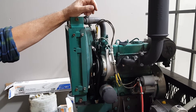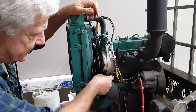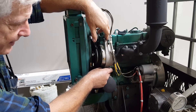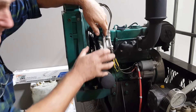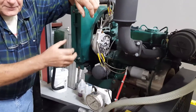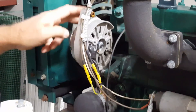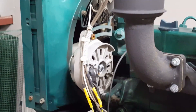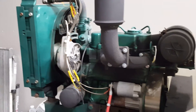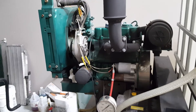It does take a few little adaptations, but typically these alternators have two points of support — one at the bottom where the piece can swivel and one at the top where you adjust the tension on the belt. Very simple. It has worked excellent. This machine has dozens of hours of reliable operation. We haven't had a problem at all — the burner has worked consistently and effectively.